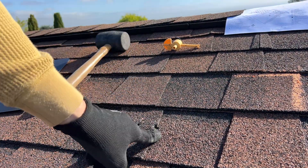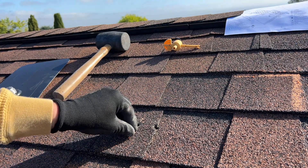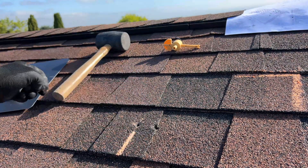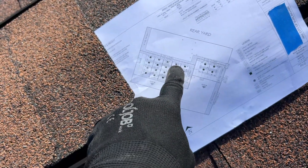When we have two holes, we have to mark which one is good and which one is not in a rafter. Usually I'm doing a line below the hole — so that means this is the good one, this is the rafter. That other one we will just seal and cover. Now we're going to continue our plans. Next one is going to be in 72 inches — we're skipping two rafters.